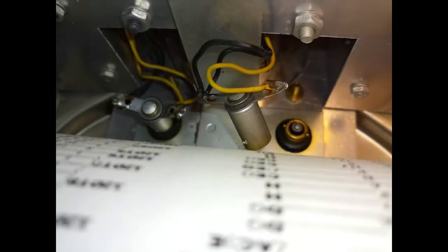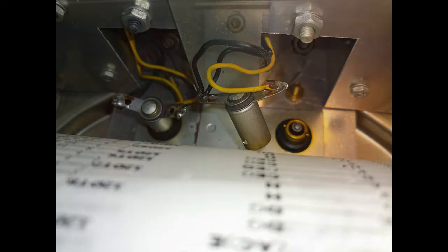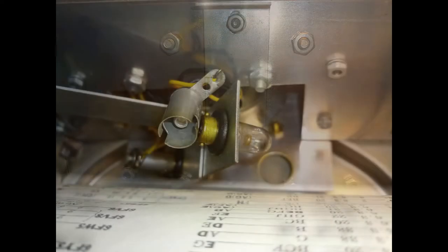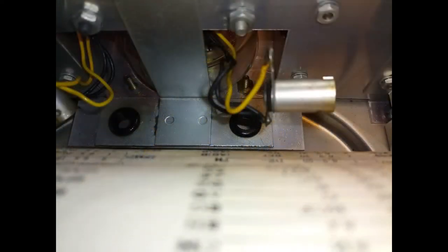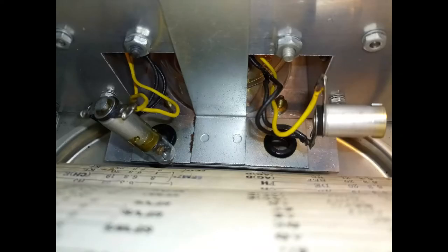The pilot lamps are mounted on a bracket, attached under the power transformer. There is only one screw and a nut to be removed to let the bracket free, allowing access to the pilot lamps. The lamps are type B9S, 6.3 volts. The lamps are pushed inside holes, through grommets, which might have become too hard, and might need to be replaced.